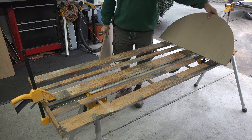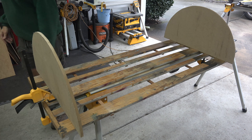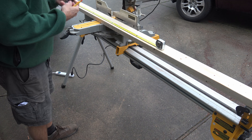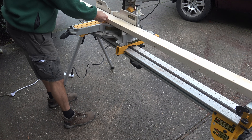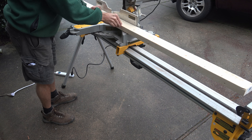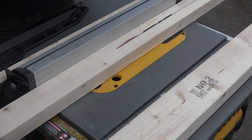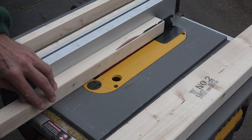When laying out my back plate between the arches, I realized that I would need another piece to make it the entire distance across the back. Yes, I am making this up as I go along. I purchased a 2x4 and thought I would save money just making the window panes out of the pine and other scrap pieces I had in the garage, so I started by cutting the 2x4 at the four-foot mark to save wood. I set my table saw at one inch and began ripping the 2x4 into strips, cutting both four-foot pieces. This gave me my six strips.